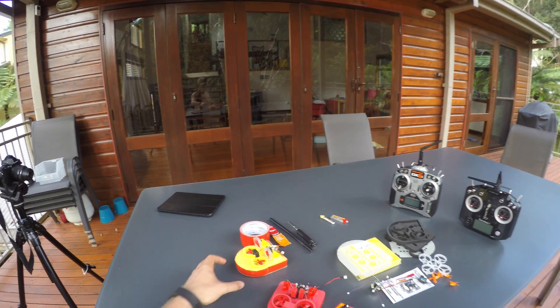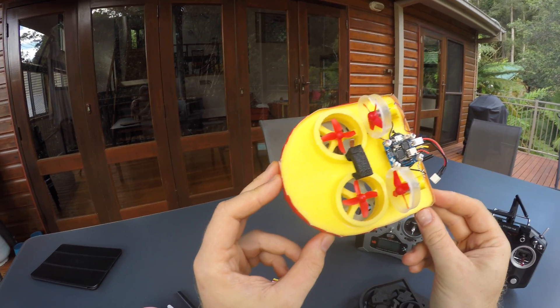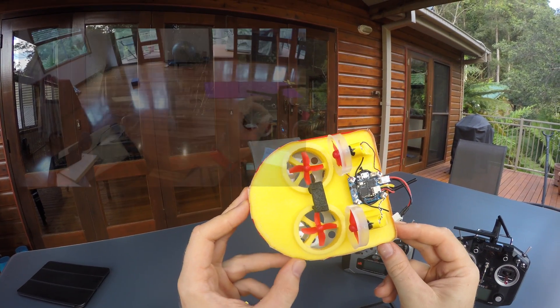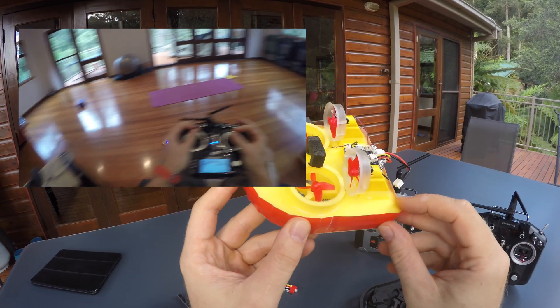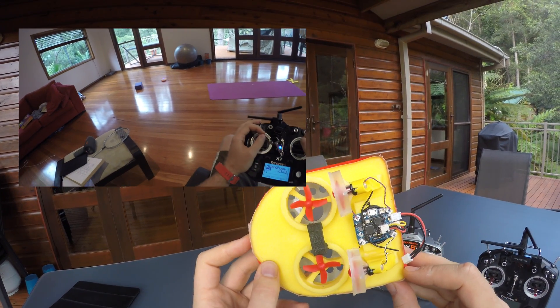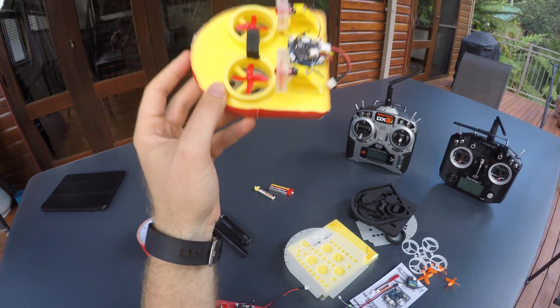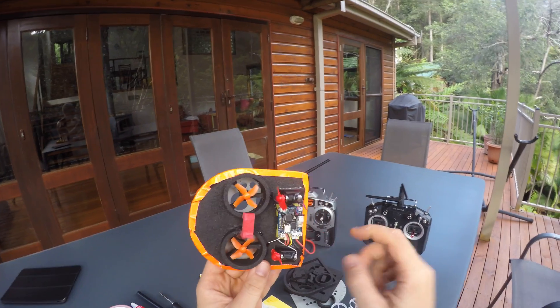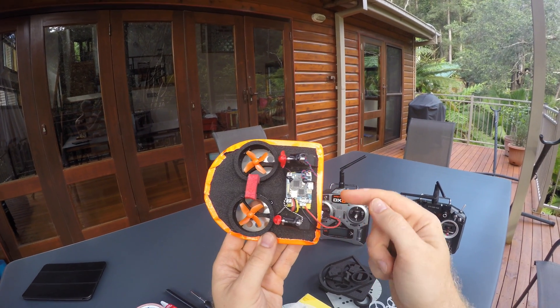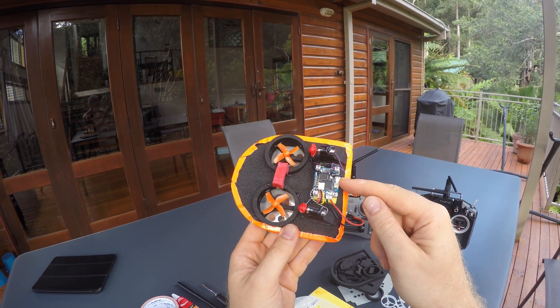Hello my friends! In the last few days I've built quite a few tiny hovercrafts. This one here runs with 17,000 kV 6mm motors in the back and 11,000 kV for the lift. The first version had the flight controller facing in default orientation, but then I started to change the orientation so I can access the USB port easier while it's installed.